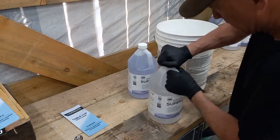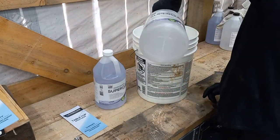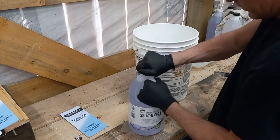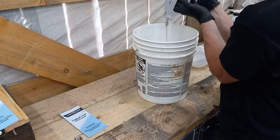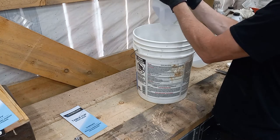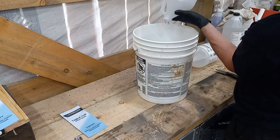I'm using Super Clear Epoxy. This is not a paid promotion — I have to buy all the epoxy I use, but I like Super Clear and I'm used to using it, so that's what I buy. I like to heat my epoxy up to around 90 degrees before I pour the bottles into the mixing bucket. Doing this shortens the work time a little bit, but it also lets air bubbles come to the top a lot faster.